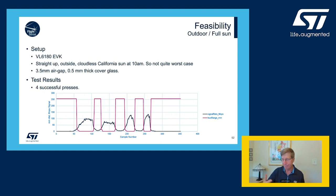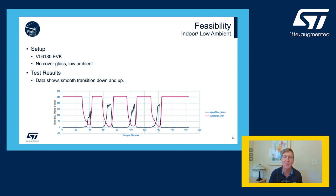The red line in this graph shows 255 — the artificial maximum. As my hand comes closer and closer, you can see the value drops closer and closer to zero, and as I take my hand away it goes back to 255. I took this graph in bright California sun outside, which is the worst case possible. The little black line is the signal strength coming from my hand — you can see four very quick button presses. In a different graph indoors, it's a lot easier: you can see around 15 to 20 millimeters you can actually see the finger getting close. Outdoors you can detect close proximity but indoors is much more accurate. Again, four simple button presses.